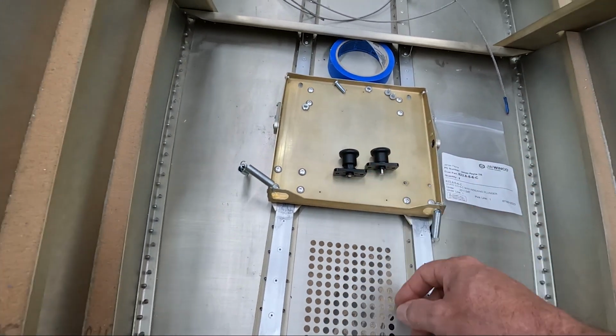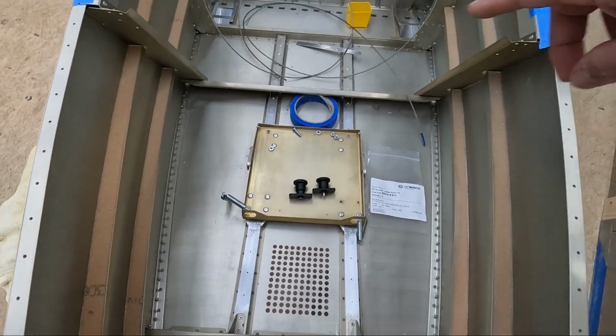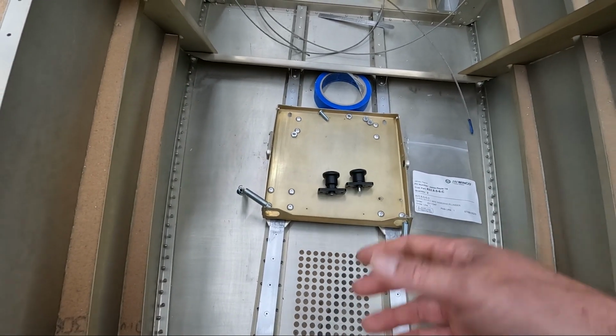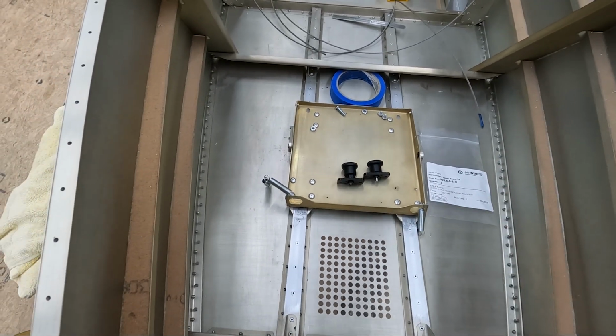And I can put one on each side, and then when this rudder pedal tray ever needs to be adjusted, I can open up the access panel up here, access these, and just pull them up, twist them, pull them up, twist them, and I can slide the tray back and forth with my hands to adjust these pedals if they need to be adjusted for anybody else, and to do my initial adjustments.